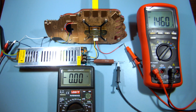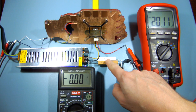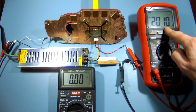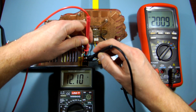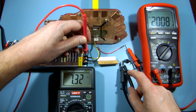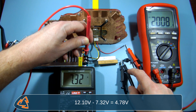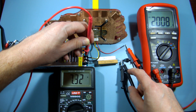Now that you know how it works, let's connect a bit heavier load to the circuit. This pair of resistors in parallel is adding almost 3 ohms and is drawing 2.01A. But let's check if the regulator is doing its job. This time the regulator's output voltage is 4.78V, which is approximately 5% below the assumed 5V.